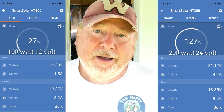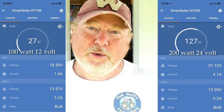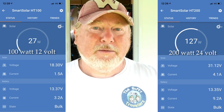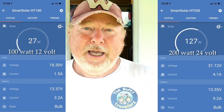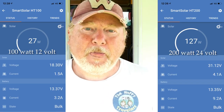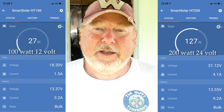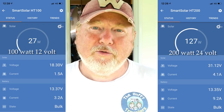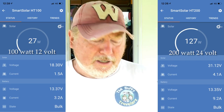My conclusion is that if you're looking to buy a solar panel, probably buy 24 volt — that seems to be the only real difference. They're both solid panels with an aluminium frame, the same cabling, and almost exactly the same MPPT controller going into the same battery. The 24 volt panel is double the size, but it's given me more than double the amps — an extra 50% more. So 24 volt panels are probably better than 12 volt panels; I'm no expert, but that's empirical evidence.